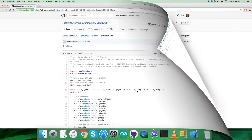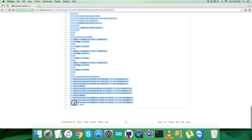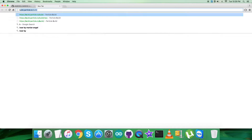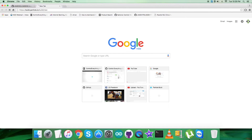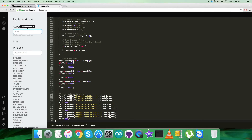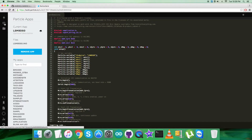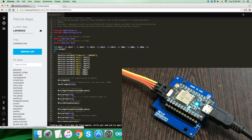For the working environment, the first step is to copy the entire Particle code as seen on screen, then open the build IDE. Create a new file, paste the entire code, and name it '9ds0' for reference, then save it. Verify and compile the code, then flash it. While flashing, check for the magenta flash which confirms the code is good to go. We now have the magenta flash and a successful flash notification at the bottom.